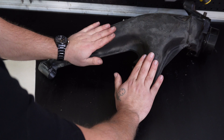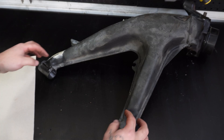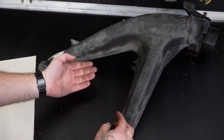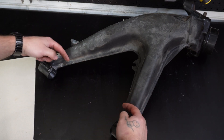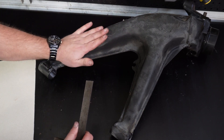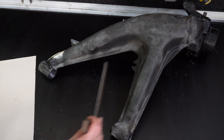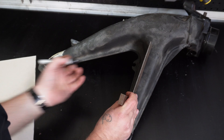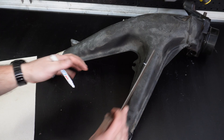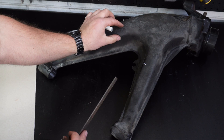When you're working out your pattern for reinforcing, you need to define where needs to be reinforced first. I've seen other places have a bar go across the bottom, and then the people who have installed it have had to modify it, so we don't want to come down too low. Up here has plenty of strength. There's a corner or a radius going across - I don't think we need to come past that mark. There's plenty of strength through here with all of these compound radiuses and curves.